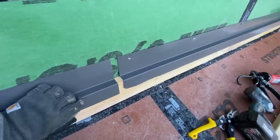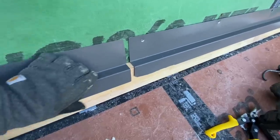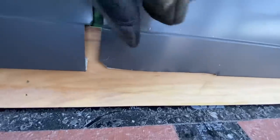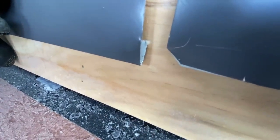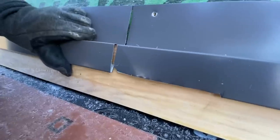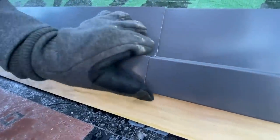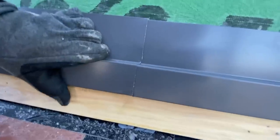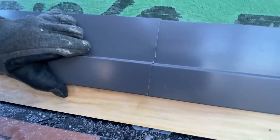One of the first things I'm doing is getting this lap joint here where two pieces overlap. Since they're made to identical sizes they don't really overlap well — they just want to pooch out. So what I did is cut the bottom edge off a piece including the hem, and I spread open the hem on the other piece a little so that it will actually slide in and engage on that hemmed area. You can see they fit up nice and tight — that little recessed area makes it happen.